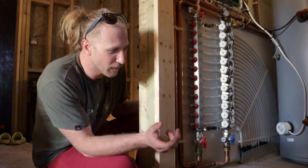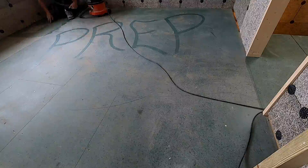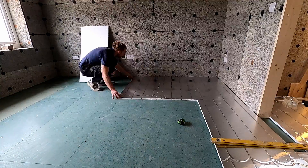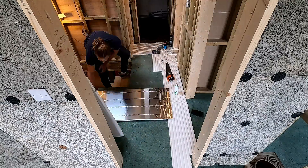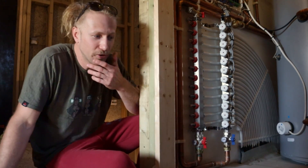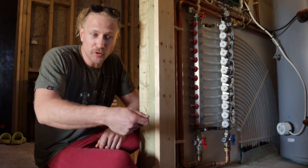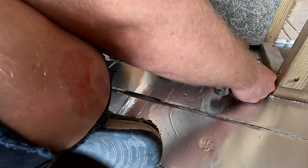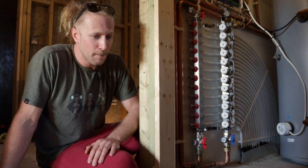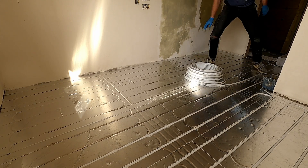This is the cupboard where everything runs into. The underfloor heating upstairs is different to downstairs — downstairs we have an in-screed system, but up here we've got an overlay system: a polystyrene reflective material that lays over the top of the tongue-and-groove flooring with pre-channelled grooves cut into it to push the pipes into. The reflective insulation sends all the heat upward rather than downward. The pipe layout upstairs also differs — downstairs the pipes come from the outside into the middle and back outwards for even heat distribution, but upstairs the grooves dictate the layout so we just ran them up and down.